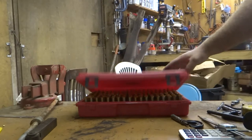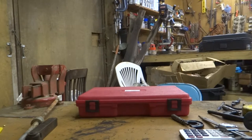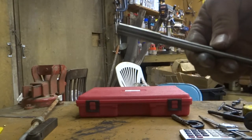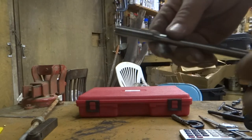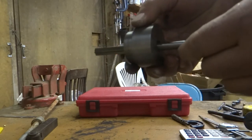And then on my valve guide reamers that I'm making, or my valve guides for the reamers, I had another issue I had to contend with. And I'll get out one of the reamers, and I'll get an old valve guide and show you. This isn't the right size, but you'll get the idea. If you look at that reamer, the shaft is smaller than the reamer head, and the depth I'm going to be reaming, this is going to stick up into my reamer guide a little bit. So I've got to actually make my reamer guide 2 different diameters when I make it.